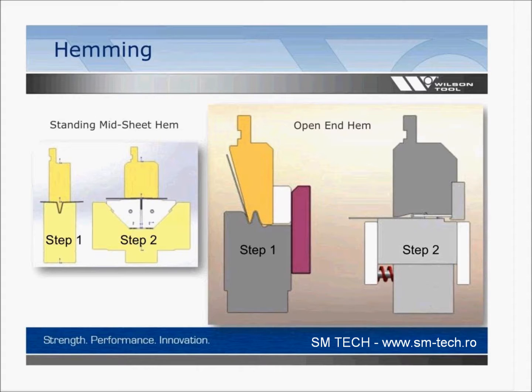And it comes down, and it hems right onto the shim. You may or may not really need the shim because you can also see on the left-hand side of that punch, there's a little concave that we're putting into the punch, so it comes down and hits a positive point so we don't crush the hem. For those of you, ironically, I just talked to somebody yesterday and they asked about that exact tool. It's not uncommon to want something that's about a material thickness, opened up and not crushed and not a teardrop. So that's how you would do it.